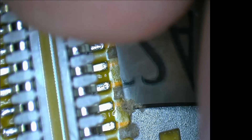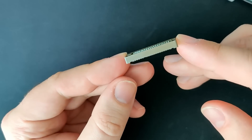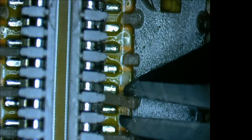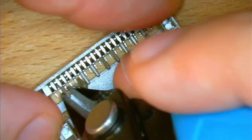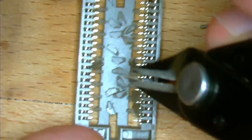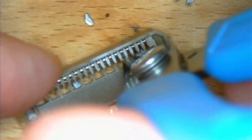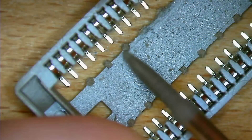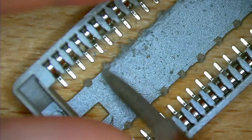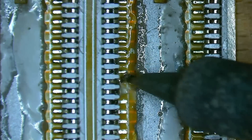In the end I had to cut the entire support structure and remove everything else inside the socket. Once done, the flipped chip sits flush with no pins sticking out. When I assembled my first two boards I had to remove the support structure while the sockets were already soldered to the board. It would have been much better to cut the support structure beforehand, when you still have access to the back. You can remove leftovers from the front as well, and for a finishing touch I used an engraving pen. Without the plastic bridges between pins it is also much easier to solder the sockets to the PCB.